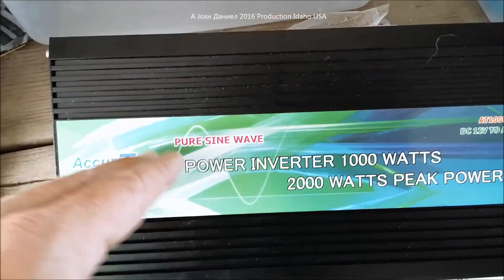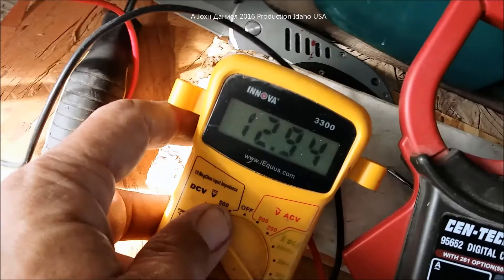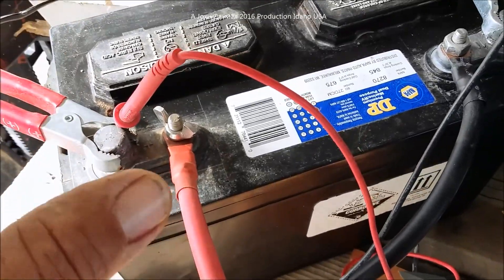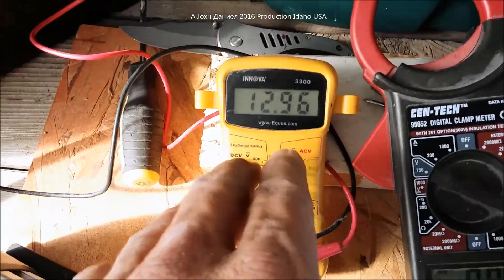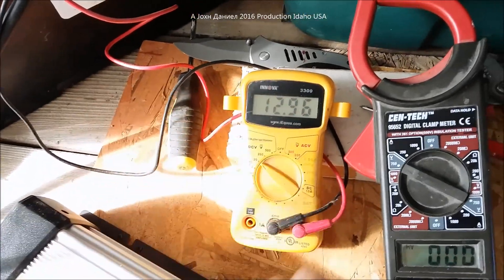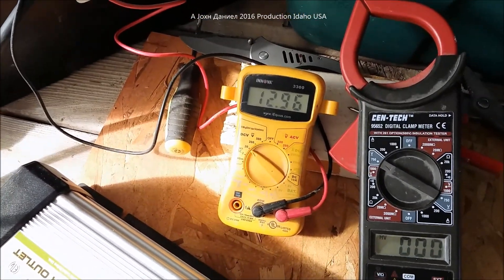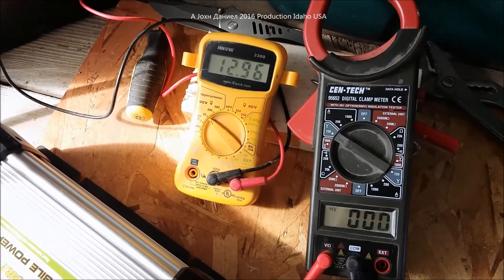Due to inaccuracies I'd keep that at a low seven. Over here we have a current battery voltage of 12.94 — the charger is on and putting in about one and a half amps just to keep the battery at 100%. The voltage is coming up above the static voltage of 12.8, which is 100% charge. 12.65 is a good safe voltage; anything below that you start losing charge.